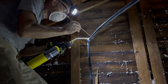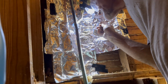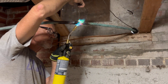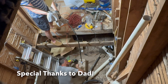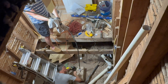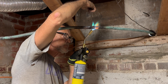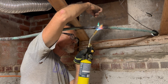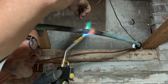We used the yellow MAP gas bottle, which burns 90 degrees hotter than a typical propane torch. When soldering, the lines need to be cherry red before you can solder in order for the solder to adhere properly to the metal — your arms get very tired holding the torch up for so long, but that is what's required. The solder will suck into the joint to make a good seal from the inside and then seal towards the outside as well as you continue to apply it. Make sure this happens so the freon doesn't leak. Also make sure there is a fire extinguisher nearby, as you are operating with an open flame in your home.